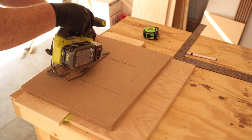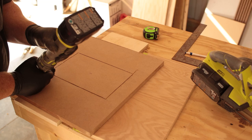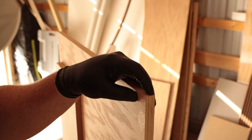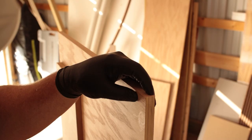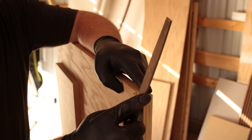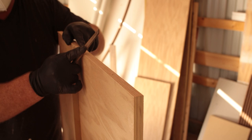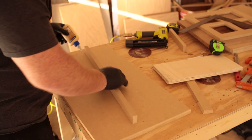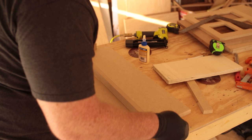Because I'm using plywood on the sides, I'm putting some edge banding or veneer on there. I learned a cool technique: you can take a file to trim the veneer rather than using a cutter or razor blade. I've had issues with the razor blade dipping into the veneer on the outside of the plywood, so the file technique worked really well. Here I'm putting the lower port brace in, making sure it's all even with plenty of room at the back and everything lined up properly.